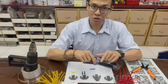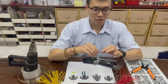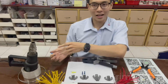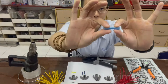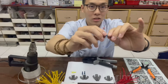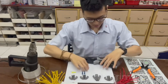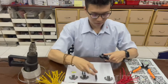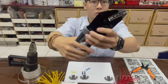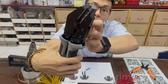The A1 is for the connector. You'll notice there's a big heat gun here, because after you crimp the terminals, you also need to apply heat around them to let the wire get waterproof. So let's start. This is what it looks like, and today we're using the blue one.